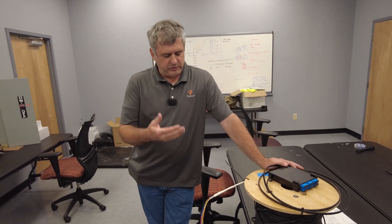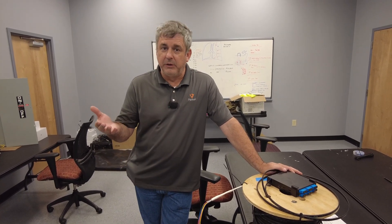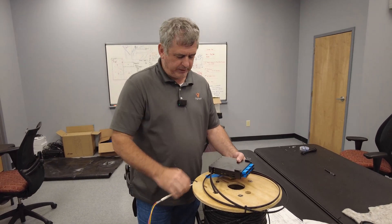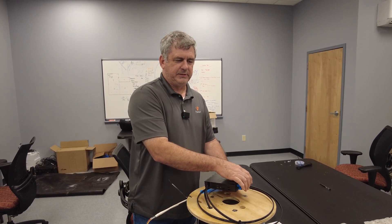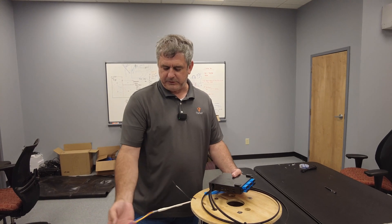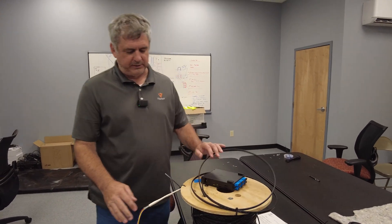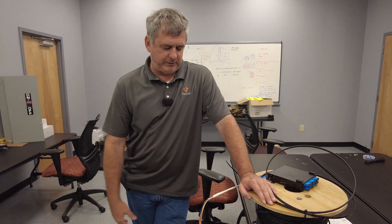We're showing you what we're trying to do — if you have any comments or experience with this we'd love to hear it. My original suggestion to the customer was to deploy the mini wall on the end, using sacrificial SC-to-SC or SC-to-LC jumpers that could be used a couple of times and then discarded. But he really wanted the flexibility of this approach because he's pulling over fences, in and out of buildings, and felt the mini wall would be too cumbersome. Please comment, like, and subscribe if you enjoy these kinds of videos.